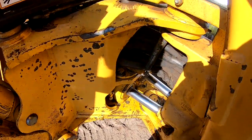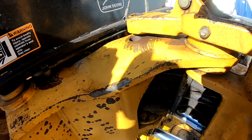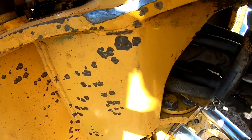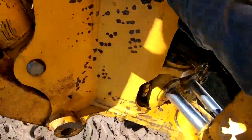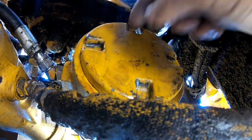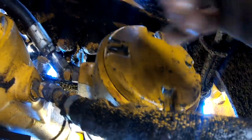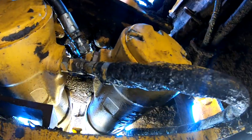Finishing up on this backhoe — won't be much of a lengthy video on this one. I've had a lot of comments, and trust me, I have pulled these — left the trunnion caps and bearing caps alone — swung the boom over and pulled the rods out before. I'm going to point something out: on these backhoes you can see where I took this loose, see the shiny marks. These cylinders have end caps on them. Sure, yeah, you can pull the rod out, but you need to have it in a vise to get this end cap off — it's tight, otherwise it's going to be moving around on you. To do a complete job, pull the cylinder out. You're not doing a complete job if you just pull the rod out, because these cylinders have end caps with o-rings. This one was leaking, so we pulled the whole thing out on both of them — I just wanted to make that point.